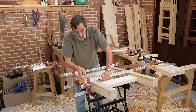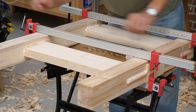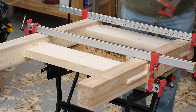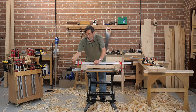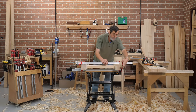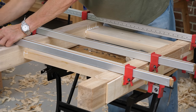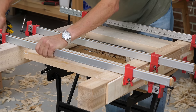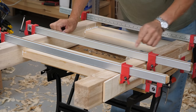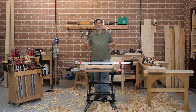And again. There you go. One more, I think. These joints are all super tight. Couple of shims. Well worth using the shims because it does help prevent clamp pressure from damaging the wood. Beautiful. Just what I wanted to see happened. The joint's perfectly tight, perfectly tight, perfectly tight. I'm going to just leave that glue there. It'll dry and I'll chisel it out later.